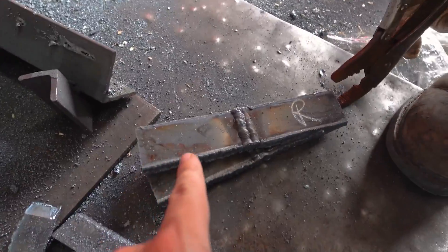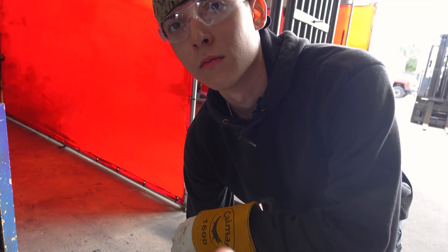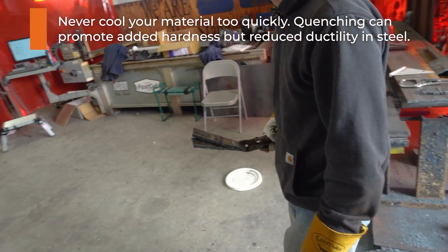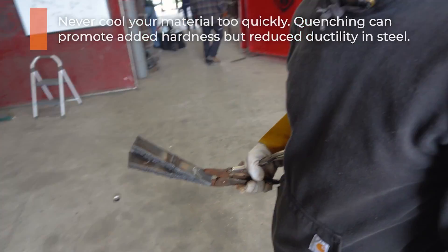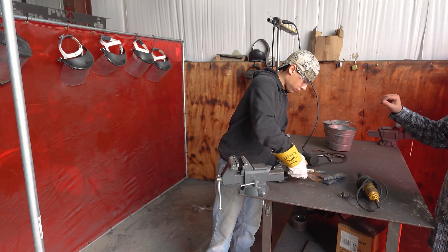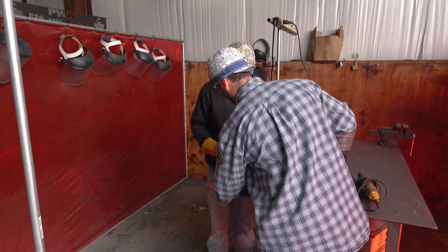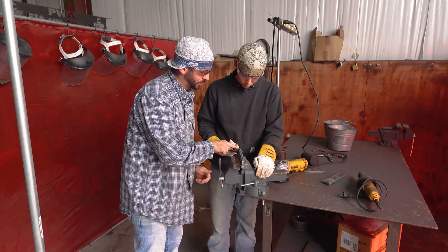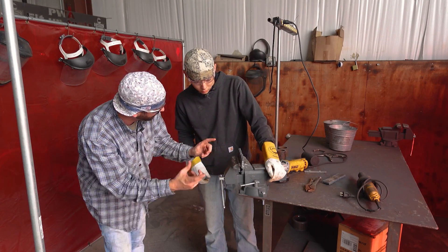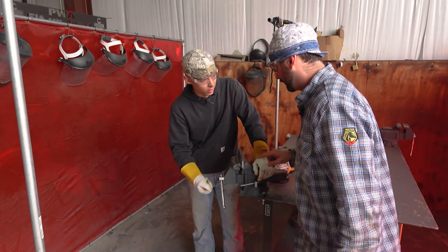Looking good — we got them cut. You can still see your chalk line, that's how we know we haven't gone past that inch and a half. You don't quench them — never cool your metal off. Even though mild steel isn't really hardenable it'll still shock it, and we're going to put it through some stuff. We're going to grind them now while they're hot. We'll clean up the sides first — always use a clamp or a vice, don't try to freehand this. We're just trying to grind out those marks without taking away from the thickness.